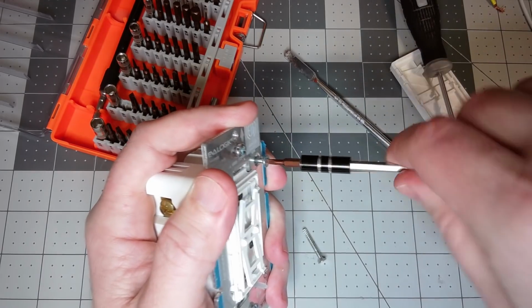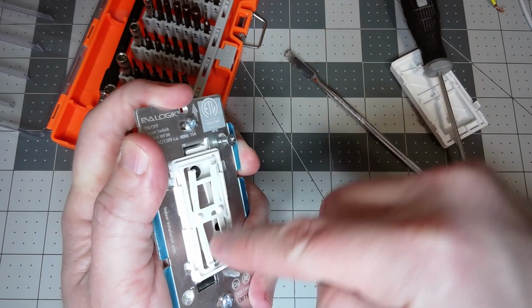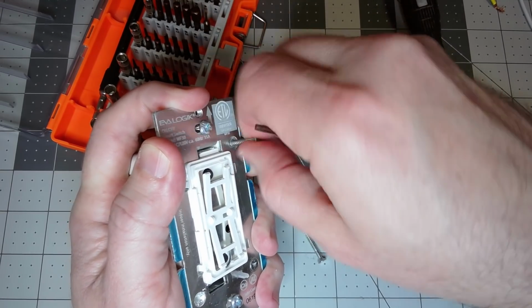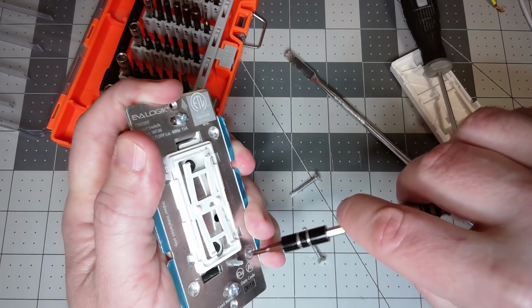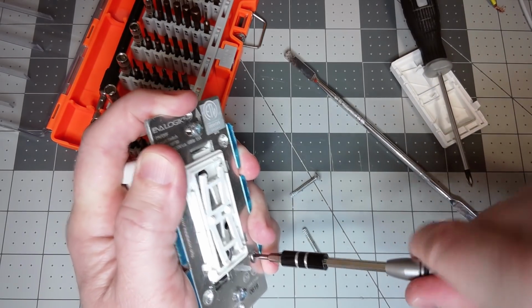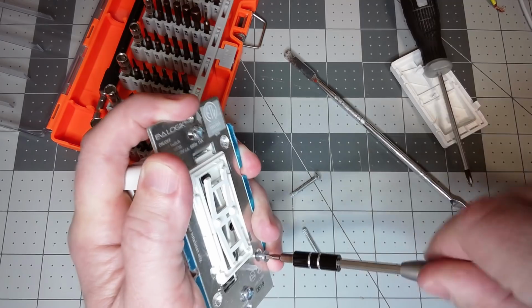Now, one thing I did find that was pretty cool with this switch is actually you could tell, even though it did the same thing, there's just one relay, you could actually tell whether there was an up push or down push on it. So you could do some interesting things. You could actually use this as a dimmer control to maybe hold it down and dim some smart lights, or basically you're just going to send commands to dim or brighten those smart lights.